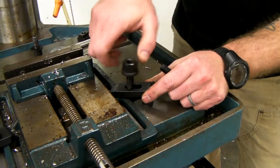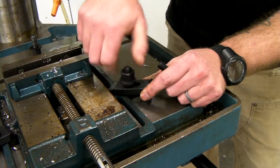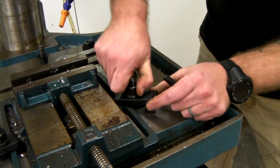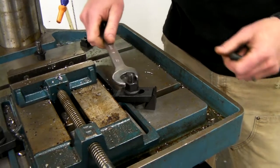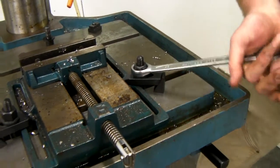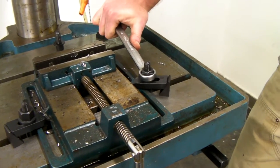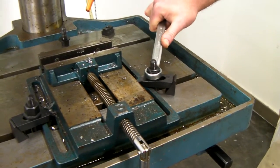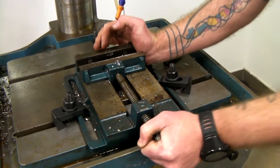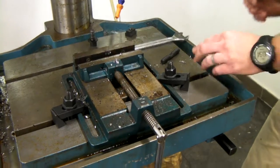The whole idea is you just tighten this down. This is a 22-millimeter wrench — we'll leave a wrench out to make life a lot easier. You hand tighten that down, and when you come back in you can use a box-end wrench or this style right here and apply force. You don't have to get crazy tight with this, just nice and snug. You just want to make sure that this isn't going to move around. If there's no play in it, it's generally tight enough.